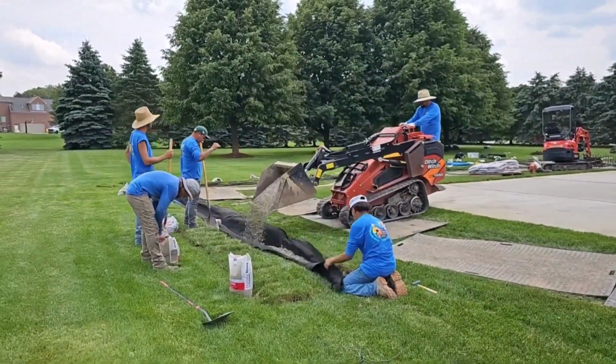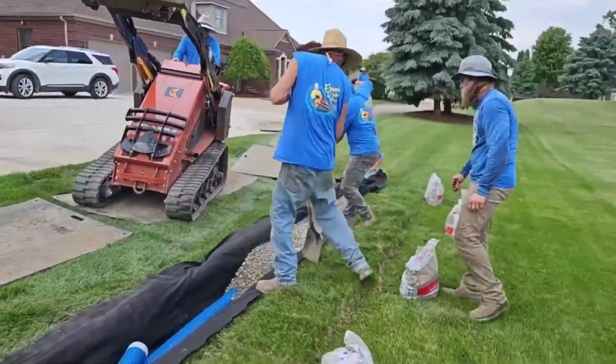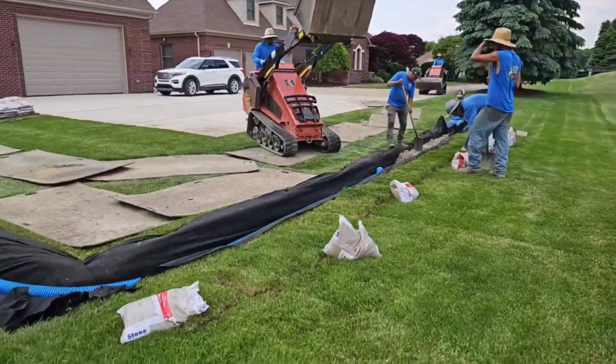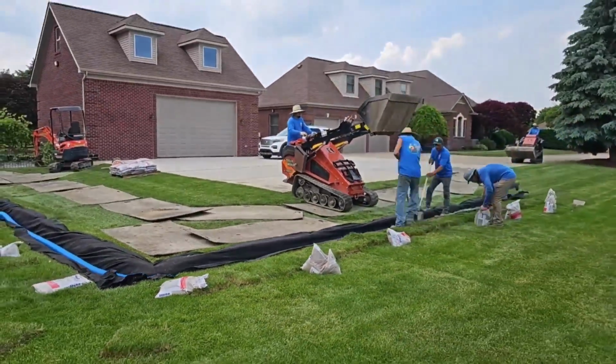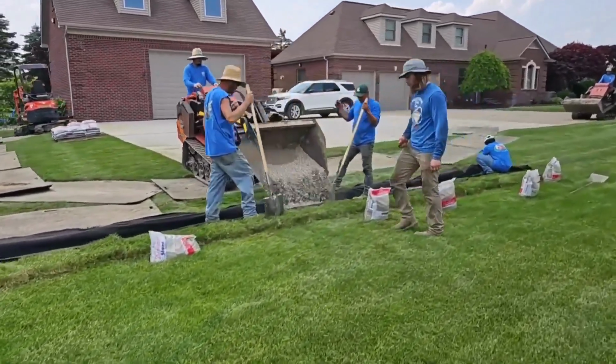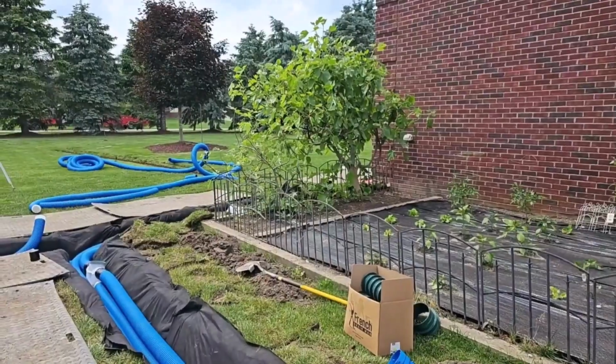It'll fall in between the trench wall and the pipe. This will make it really strong for driving a car over it or driving a big lawnmower over it if you use the smaller stone. And a quad pack has more airspace for pruning tree roots off than 2 pipes on the bottom with larger stone.